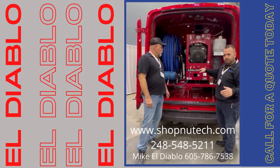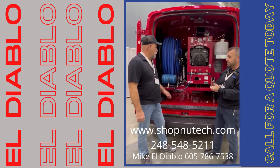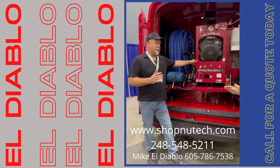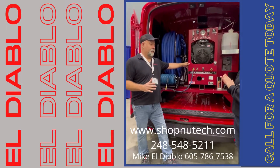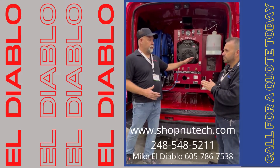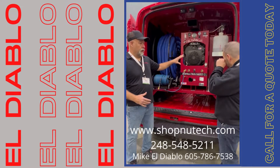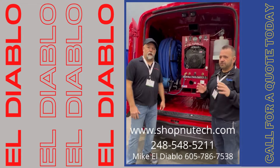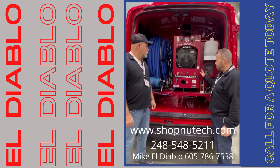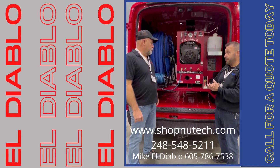You guys improved the powder coating — the old El Diablos, although the powder coating was good, the new ones are substantially better. You went to an all-new powder coat system. Actually, it wasn't even powder coated before — it was like a dump truck paint cooked on. When I toured the factory, I figured out the problem: you can't bake that on stainless steel. It's got to be prepped — we sandblast them, treat them with a bonding coating, then powder coat on top to promote sticking. We've noticed a gigantic difference over the last 24 to 30 months. No chipping, peeling, or rusting — they come in looking like new.